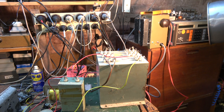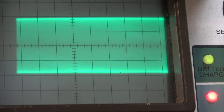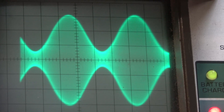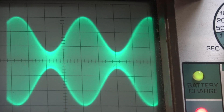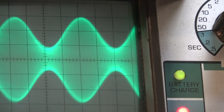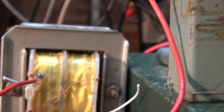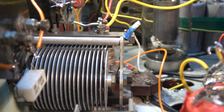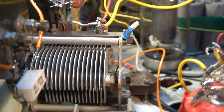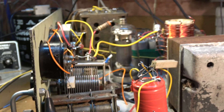That's an easy way out if you haven't got a UM3 or another proper modulation transformer. Looking at the modulation — that's putting out 120 watts. Look at that — plenty in reserve, can certainly over-modulate which is what you want. That's at 400 Hz. It's designed to work from 160 meters up to 5 MHz, so if I ever get my HF broadcasting licence we can press it into service.